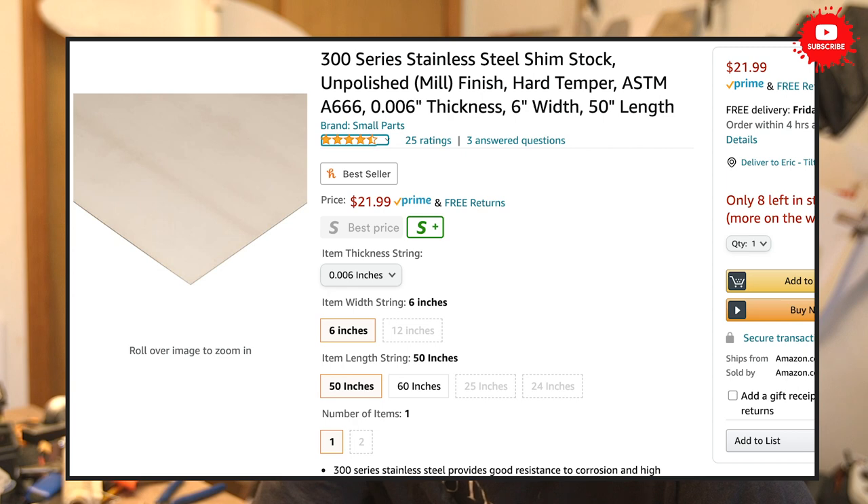One major thing I have changed since then is that I have drilled a hole through the shaft going through the front pulley, and this is to keep it from spinning. I was having problems with losing steps during printing — I found out the shaft was spinning inside of the pulley. So I did this to fix that, and it actually helped. Now I'm using some 0.06mm spring steel sheet, and it comes in a roll of 6 inches wide by however long it needs to be — there's a couple inches extra.